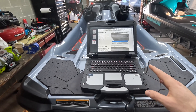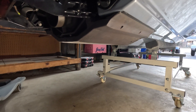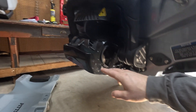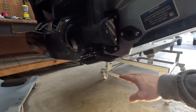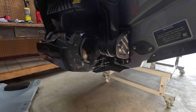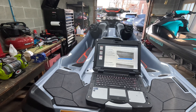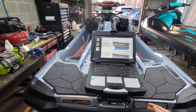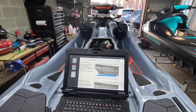Reva does offer a service where you can remove your ride plate and send it in to them and they will fix it for you, which is perfectly fine. The downside is that the ride plate on a Sea-Doo is pretty difficult to get out — there is coolant being passed through here, it's part of the cooling system. You have to take out the jet pump, the cooling system hoses from the inside, remove the intake grate, there are a bunch of hoses, bolts, and marine sealant holding the ride plate in. On top of that you still have to pay to ship it to Reva and pay for the service, so I've seen some people pay north of $800–$900 including shipping.